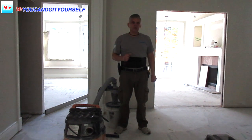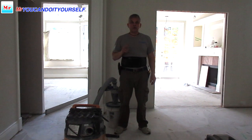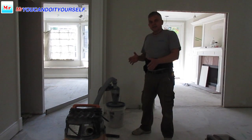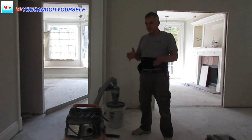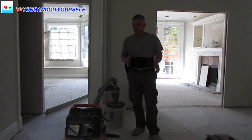In this house on the main floor I want to start doing a double glue down. First of all I want to do cork, 1/4 inch, and then over the cork I want to glue hardwood floor. Before I start the floor installation, I have to check the quality of this subfloor. So here is a radiant heat subfloor and concrete subfloor, and this house was built a long time ago.